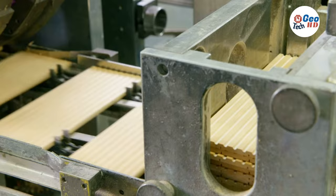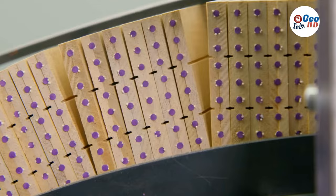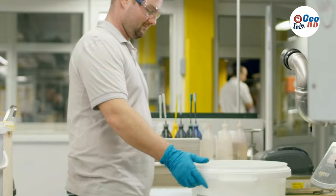Within seconds, another wide-grooved slat is glued on top, sandwiching the leads. When the glue dries, the slats are fed through a cutting machine. Fast-revolving steel blades trim the wood into round or hexagonal shapes, one side at a time. The same machine cuts apart each slat into eight separate pencils.